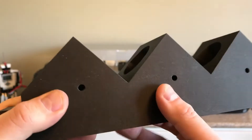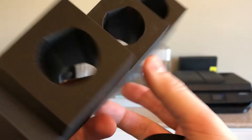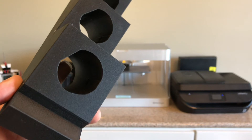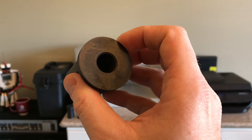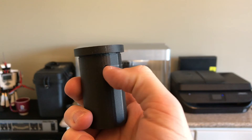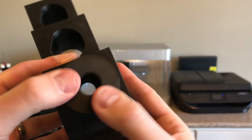We also have these holes in the side. Inside the bore here, right on the other side of this circle, is a hollow hex. What we're going to do is put a hex nut inside of that to give some threads to be able to lock in these liners. This is the part that the workpiece being ground will get pressed into — it also has the same kind of configuration with a hole and a hollow hex on the inside. These just slide in here, just like that.